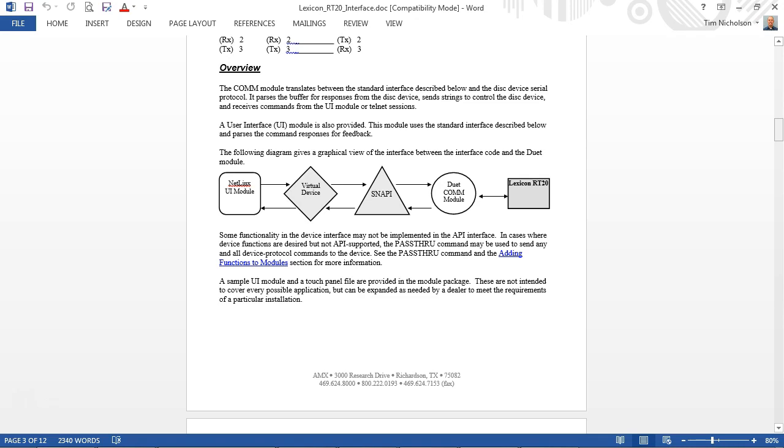As mentioned above, you could simply set all the device numbers in your hardware to match what appears in the main AXS file. Then load the entire workspace to your master controller and touch panel, and you would be controlling your third-party device. So this diagram explains how the pre-built module works. The only item not shown in the flowchart is the main.axs file. That's because it's only used to call the other files and define the devices.